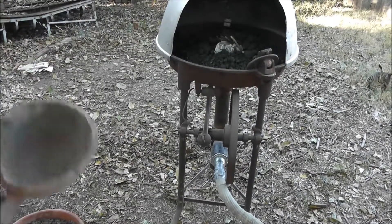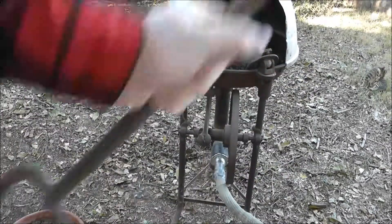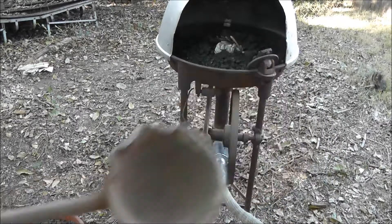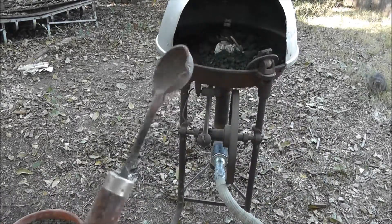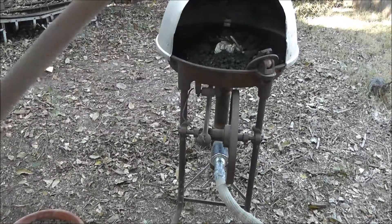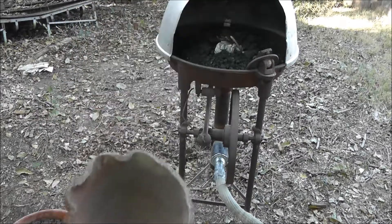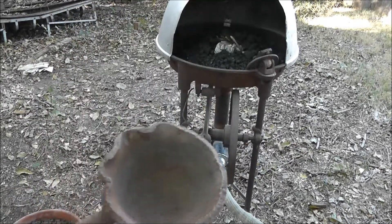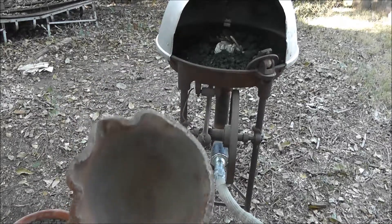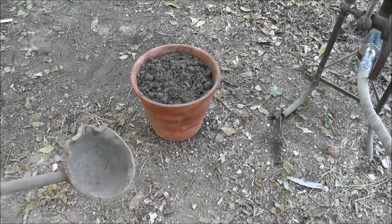What I'm going to use for a crucible — it's not really a crucible, it's a homemade large ladle. And I'm going to use a small ladle for skimming the impurities off that float to the top. You'll be amazed at how many aluminum cans it takes to even fill this — it takes so many. It's why most people don't do cans; scrap aluminum ladders and stuff like that go a whole lot further. There are a lot of different crucibles you can use, but this is going to be my setup on this particular project.